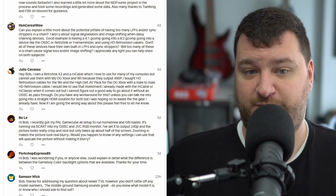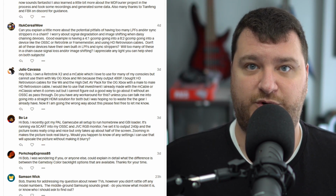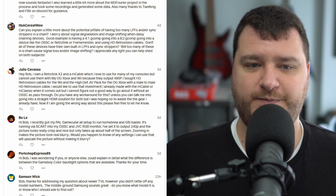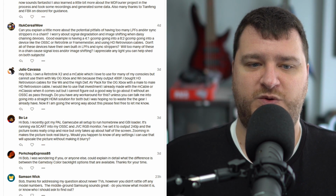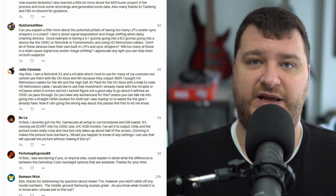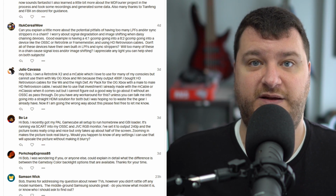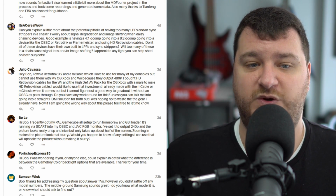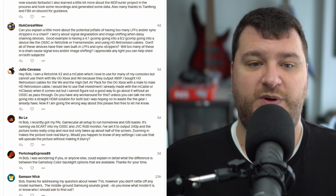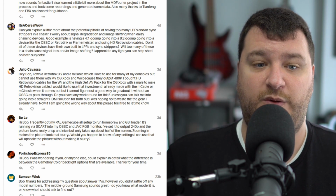And next, sync strippers. They don't have anything to do with low-pass filters, at least in this context of what we're talking about. There's sync filtering on the OSSC, but that's a little different. So the reason those were so widely talked about, especially when I first started the website, is because a lot of the things that we have today don't exist. So there were a lot of switches out there that required C-Sync, not composite video or Luma as sync. There was a whole bunch of devices out there, and the easy fix for everything was just throw a sync stripper in it. But now that there's a lot more knowledge out there, and better understanding and better devices, you don't really need one.